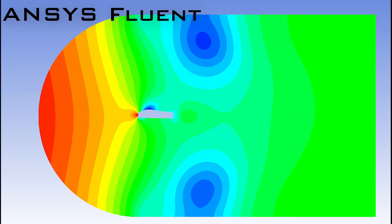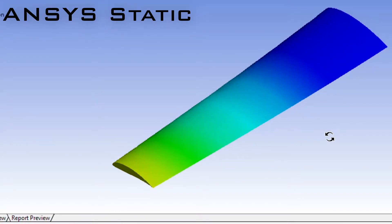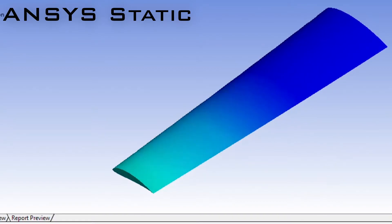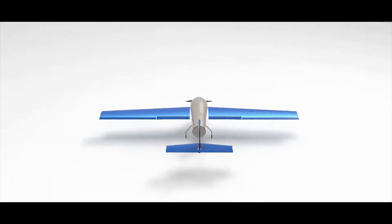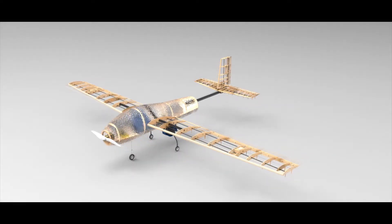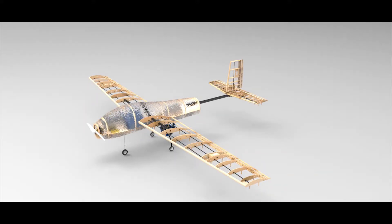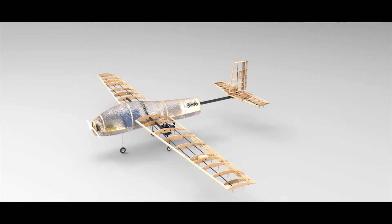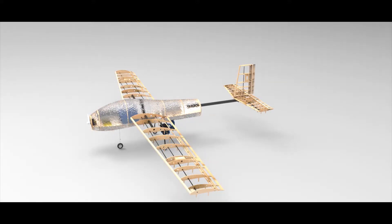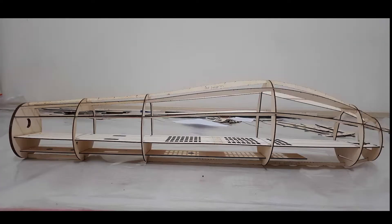The main purpose of the design is to use the fuselage as a lifting body. The wings have been selected according to the weight of the aircraft. The total weight of the aircraft was estimated at approximately 9 kilograms. The center of mass has been determined by estimating the weight of electronic devices and other components. The internal wing skeleton contains birch wood ribs for stability. Birch wood is a high strength material perfectly suitable for designs like ours. Another material used is balsa — a soft, light, low-strength material used to achieve a fine structure with weightless properties.